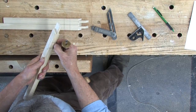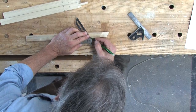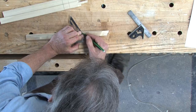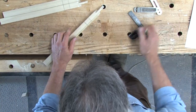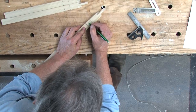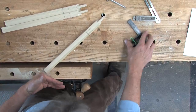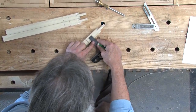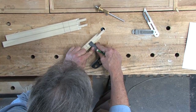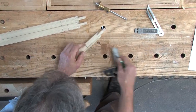The other thing that the cutting gauge does is it's actually making a finished cut at the very beginning. So from here on in, I want to be preserving these lines. And as long as I don't destroy that cut edge, I can nibble my way to it however way I want to do it. And again, I want to make sure that I've got about 3/8 in between. So I am a 64th over, more or less.